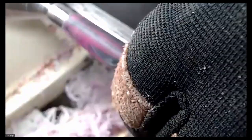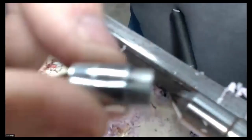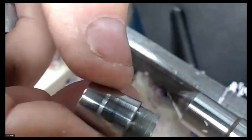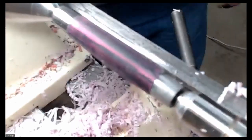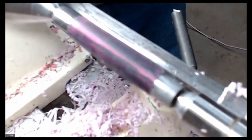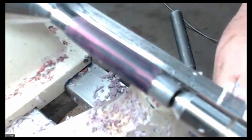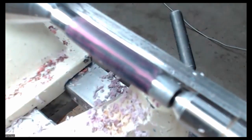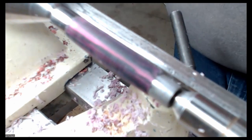Oh, you mean the bushing? I hit the bushing, yep. Sorry, I said mandrel, I meant bushing. So I hit the bushing and I undercut it by a few thousandths. You can see that. So that one now goes in my scrap bin and it'll get made into something else. Luckily, I have extra ones. Carbide will cut these bushings, as you can see. Only in a demo. Well, they do use carbide for machining steel. Yep, and this is soft steel, whatever this is. I'm not sure what they make those bushings out of, but it's pretty soft because I've made them into different sizes for doing different things.